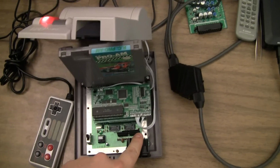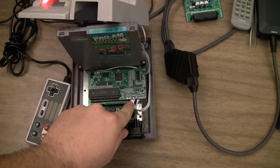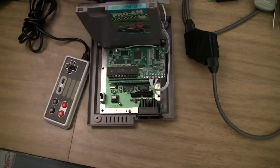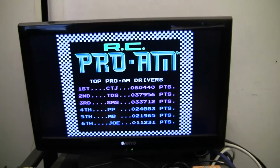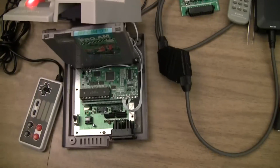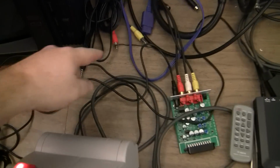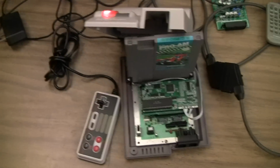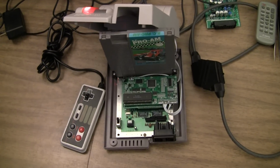Okay, so I've still got the composite video and composite sync pins both wired to composite sync output of the RGB board. And I think what I'm going to do is put the camera in front of the LCD here and just go through some of the different ways, HDMI and component. And I also have this video I can show as well, since that's still hooked up. And I'll no longer be able to show composite.